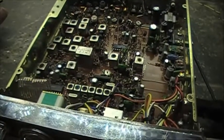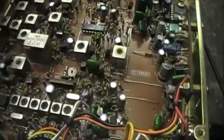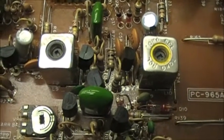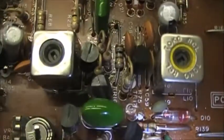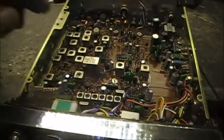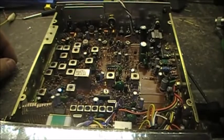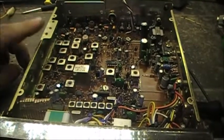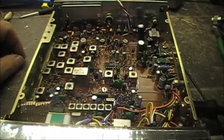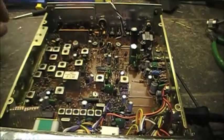Ray was helping me with this a couple of nights ago and we discovered the 8-volt rail was missing from these transistors down here. With his help we found that these transistors were completely dead. We swapped them out and got this section alive again. Now I need to put an RF signal generator on it and go through the circuit section by section to figure out where the signal is disappearing to, because it surely is disappearing somewhere.